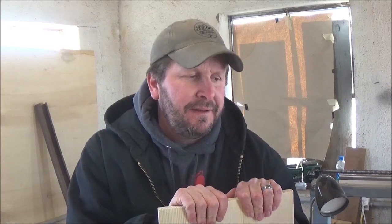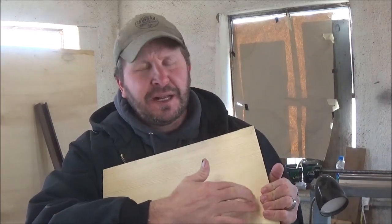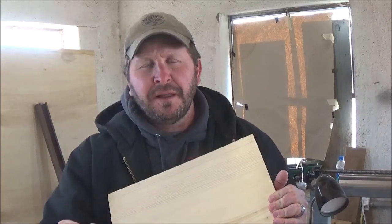The last question I've got to answer today is somebody was asking me about when I cut my material — my wood — how much room am I leaving for clamps and securing it. Like this is a 15-inch piece of wood, and at most what this is going to cover is probably 13 inches. I usually try to leave an inch on each end, that way I've got ample room on the corners to put my clamps and I don't have to worry about getting into them while it's cutting. A lot of times if I have a piece that's already extra length, I don't even worry about trimming it down until after I've got the project made, because basically it's a waste of time in case I screw it up. So I usually leave about an inch, sometimes an inch all the way around if I know I'm going to have to clamp on the sides. That's basically how I size everything.